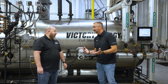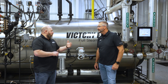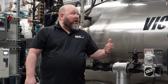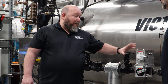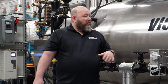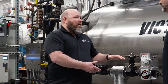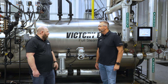It's not a one-size-fits-all — it's an engineered product. Our inside sales team is great. If you call in and say you need a feed water valve, they'll walk you through all the questions to make sure they get that valve selected the right way. One thing that's also unique about this valve: it is a directional valve for that Class 6 shutoff. The flow direction does matter — you need to know if it's flowing left to right or right to left. We make sure we put the actuator and valve in the right configuration so when you get it, you won't have any leaking issues from it being installed backwards.